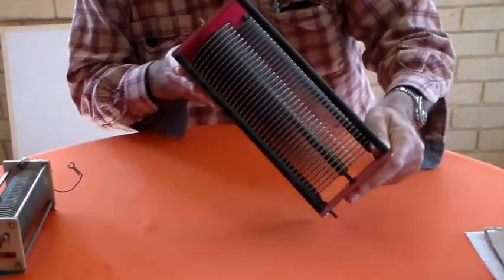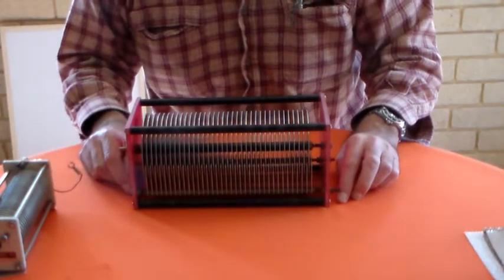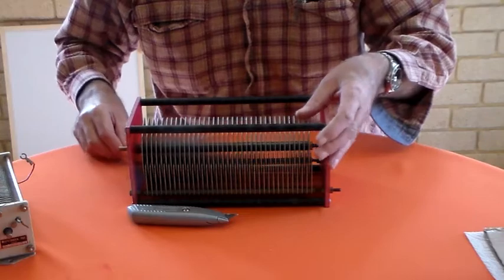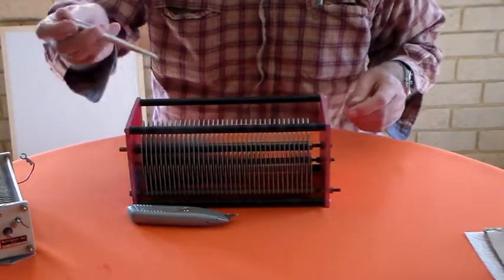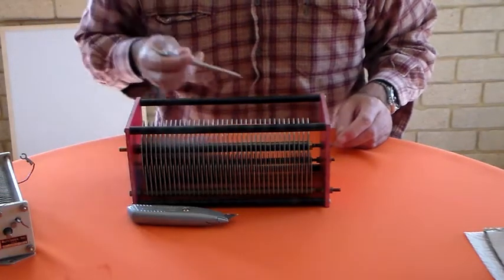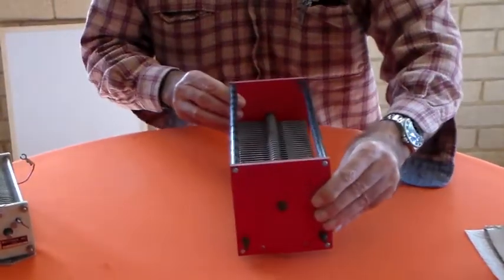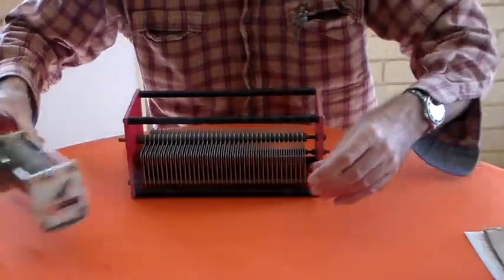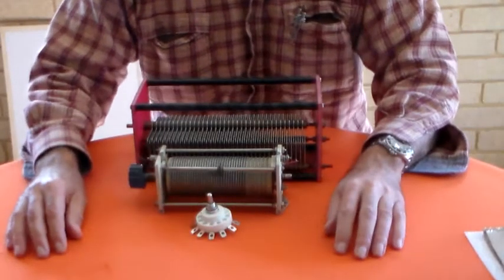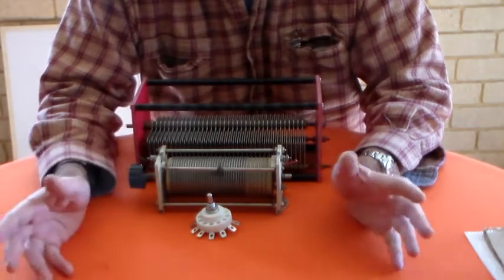I don't know exactly what the inductance of the roller inductor is, but you can see roughly what size it is — there's a hand and a Stanley knife for scale, and you can see the plate spacing. It should be able to take a reasonable amount of power. So those are the components: the capacitor, the roller inductor, and the switch for my L-match. I'll get a box sorted out, put it together, and it should make quite a good little tuner.